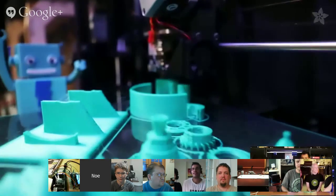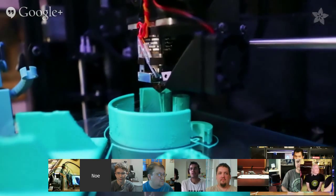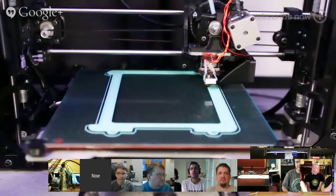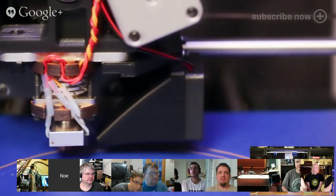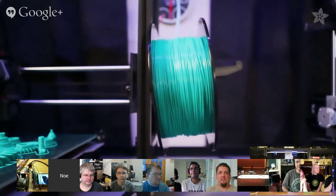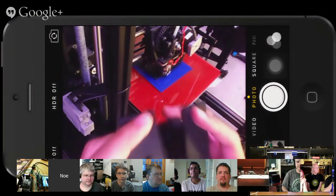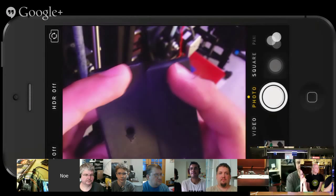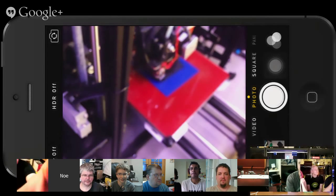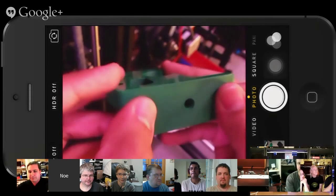How's it going, guys? Happy evening. Getting ready for another action-packed 3D Thursday tomorrow. We released the 1.75 filament upgrade for the Taz. One of the first things people might have noticed when they bought it from us — if they got some NinjaFlex as well — is that the filament diameter is different. What we did there is simply update the wall thickness of the old extruder to the new 1.75, which is pretty much more standard.